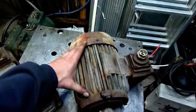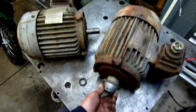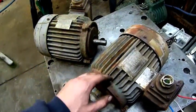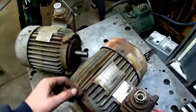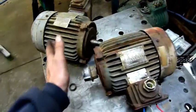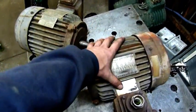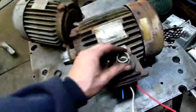The stator and rotor are a little bit longer on the 2 horsepower but they seem to be the same diameter, so I'm hoping the shroud and fan fit the same. The output shaft is the same diameter and the key slot's the same size. In induction motors, the longer the rotor and stator, the more torque it has — so you get more horsepower out of it with a longer stator and rotor.